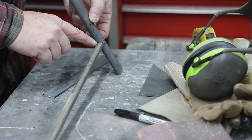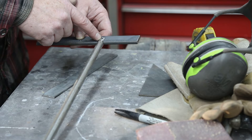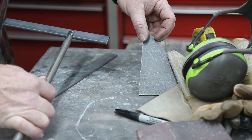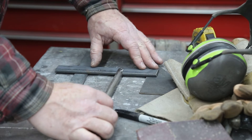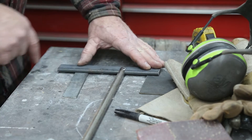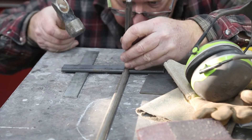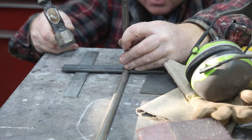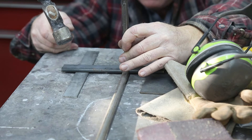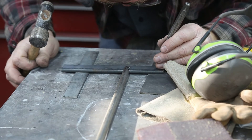I confirmed my measurements in my slot — I want to make sure it's five-eighths down. Now the perpendicular hole that we have to drill is three-sixteenths for the pin. So what I did was I put a piece of quarter stock in my slot, with an eighth inch on each side, lay that down, and I know that's going to be exactly perpendicular if I get my punch straight up and down. I got my quarter-inch mark, get down on my knees — you'll be surprised at how accurate you can get it with your eye. Give a little tap first, see how it looks — that's pretty good.